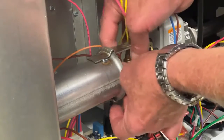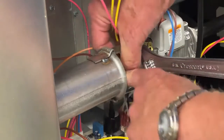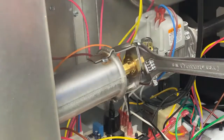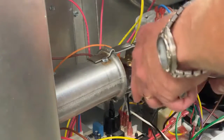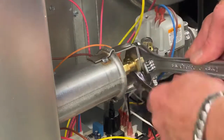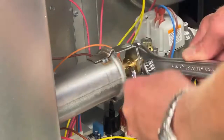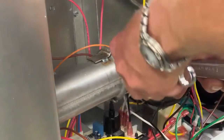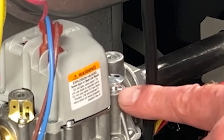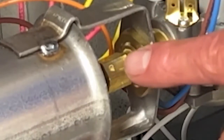We're going to install the orifice and snug it up. This will be one of the easiest conversions because it's a single orifice unit, so you don't have to change multiple orifices. And if you are making adjustments for altitude, it's a manifold pressure derate and not an orifice change — very simple propane conversion to do in the field. We've installed the new LP spring with an LP regulator cap, and we've installed the burner gas manifold orifice.